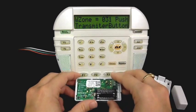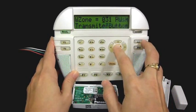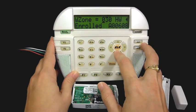Acknowledge it's enrolled, and the keypad will automatically advance to the next zone. This is convenient if you're learning in multiple zones — you don't have to keep going back to the keypad. You can just go through and learn in your sensors. But I want to stop here, so I'm going to press the ELK key, then down arrow back to zone 30, and you can see that it's enrolled.